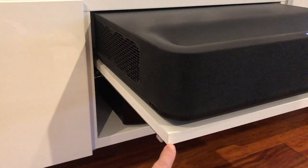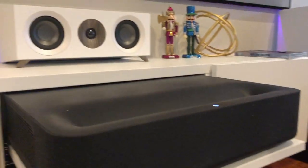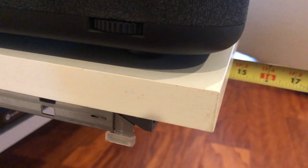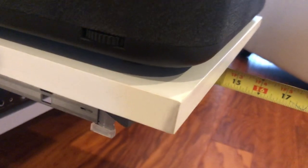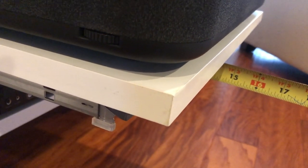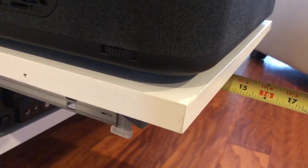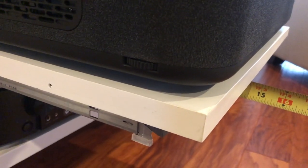This is just a custom shelf. The shelf I cut custom — it's about 14 and three-quarter inches in length. You can actually buy this material from Home Depot. It comes in eight-foot or maybe six-foot lengths, and it's three-quarter inch shelving. I believe they call it melamine, which is the white material you see on here.